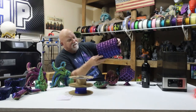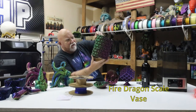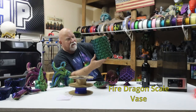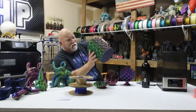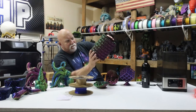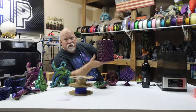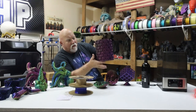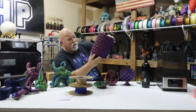Then I had this base here — I believe it's a Dragon base or something, I think it's from Printables. Printed out really nice. I did not use vase mode. It has a little bit of give to it. My layers were something like zero top layers, four perimeter, four bottom, and no infill obviously. That came out really nice.